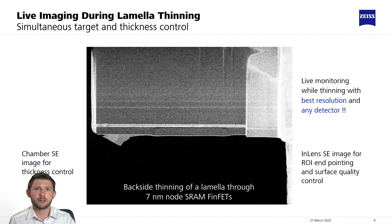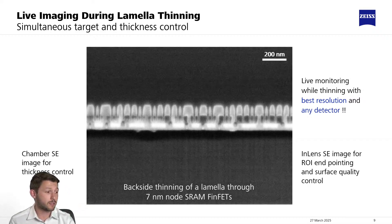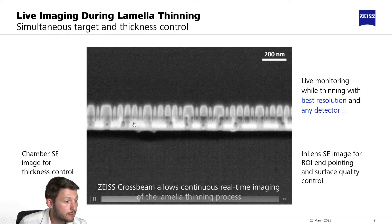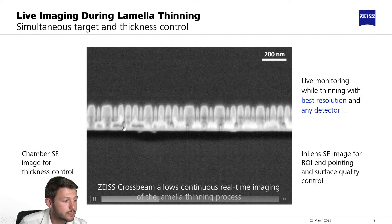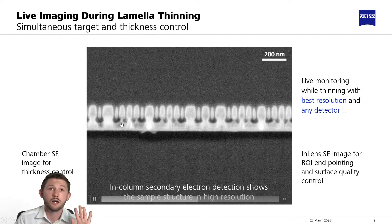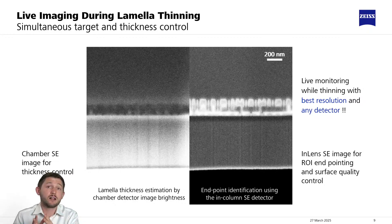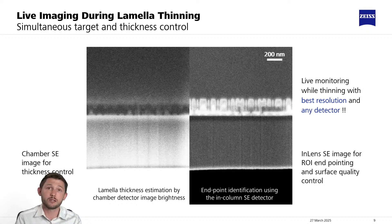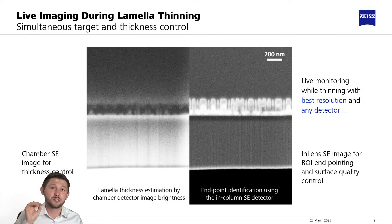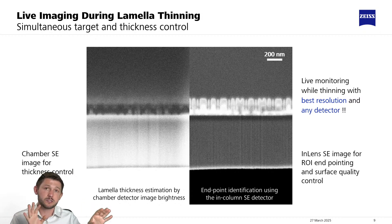This is an example on a 7nm node SRAM FinFET logic device. As you zoom in at any acceleration voltage on the FIB or SEM — even low KV polishing — we can see the evolution of the structure. Some fins start showing up, and at any point we can choose to freeze our milling and stop and go from the other side, giving us total control over where we make the right lamella. The left side now shows a different detector which gives you transparency information related to thickness, so the combination of these two levels of information allows you to make the right lamella at the right location and at the right thickness.